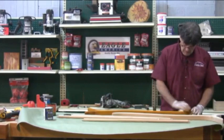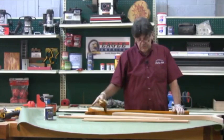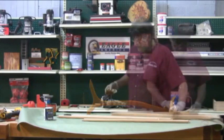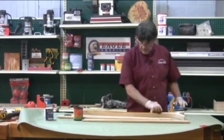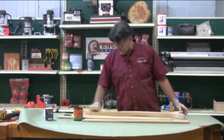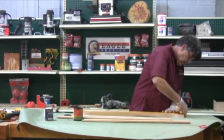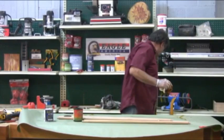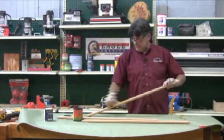Now all I'm going to worry about before assembly is my stretchers and the inside. Anywhere I can't get to easily once it's assembled. And what I'm using is an amber or a yellow for a trace coat. Use a water base or an alcohol base. Oil bases have a tendency to not dry real well, and they have stains and whatever, and they clog up your sandpaper, and they don't sand off too hot. And I like a light colored yellow, amber, something of that nature, because in the general scheme of the finishing realm, it's not going to conflict with much of anything I put on here.